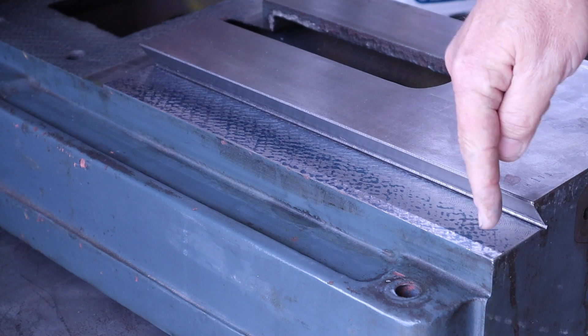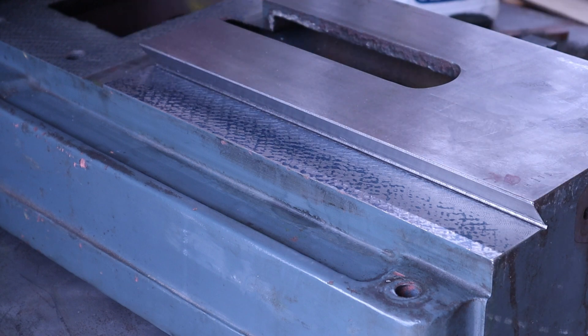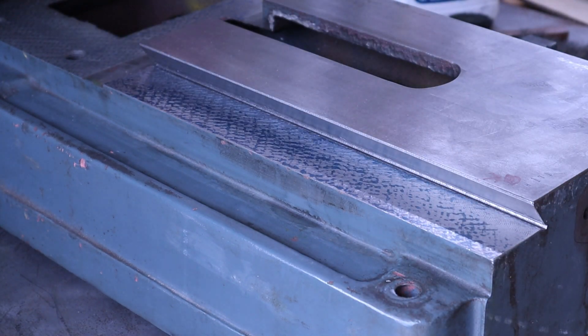From this you can see I have contact here, missing some here, and contact with light contact there as well. Here's my prism to slide in — I'm trying to focus just in this one smaller area. That pattern repeats and then it also goes down into the edges. With this slightly closer look, we are getting roughly the same blue contact back up in the back there, and that's what I'm after. You can still see the bare area there and also back along the back edge — it's easier to work the front than it is to work underneath the dovetail.